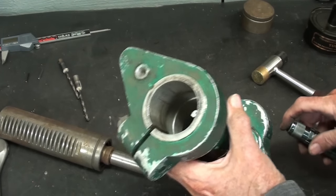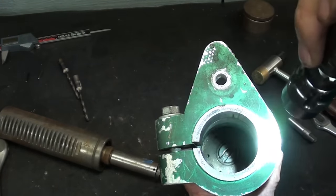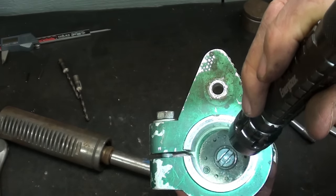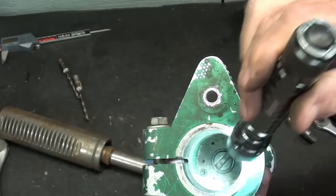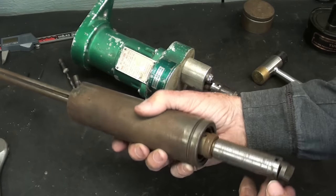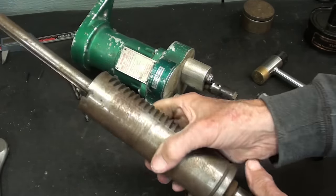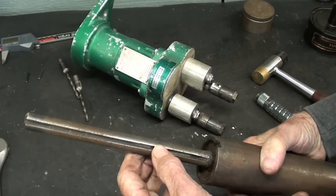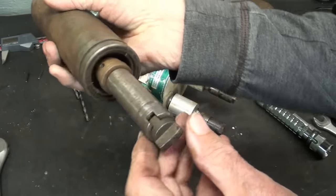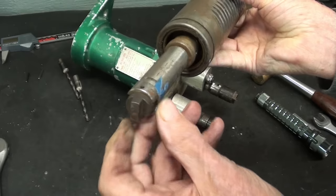This unit has to be driven by the drill press motor. When we look down into the bore, you can see that little adapter with a slot in it — that's what drives it. The seller told me this was the quill out of a Delta drill press. You can see the rack and the keyways. Usually there's a spline, but on the end of it there's this lug here.